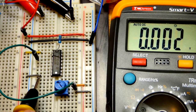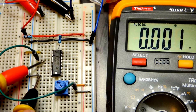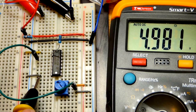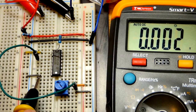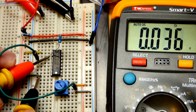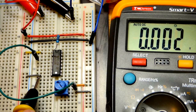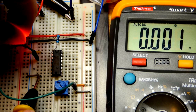We can take a 100 kilohm resistor to the negative rail and you'll see the voltage holds quite a bit better - we lose just a tiny bit. At that low current level it holds pretty well. With a 10 kilohm resistor it drops a bit but still holds better. The less current you demand of it, the better it holds the rail voltage.